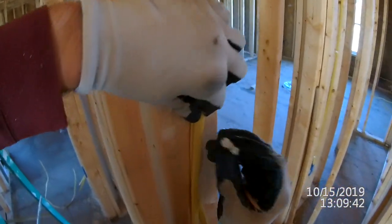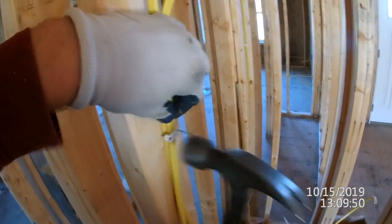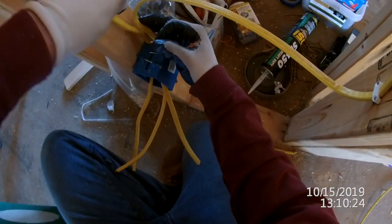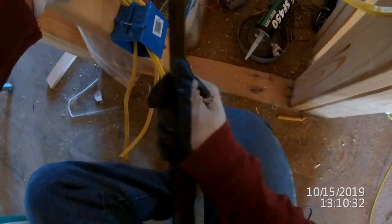The main takeaways from this video when you're roughing in outlets and switches: try to keep your outlets no more than six foot apart, then run your switch boxes down from the ceiling 48 and 5/8 inch, and run your outlets up from the floor 14 inches to the bottom of the outlet. Thanks for watching — subscribe and like, I'd appreciate it.